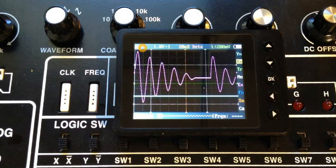We have an indicator here that says 'auto' — this tells you what kind of trigger mode we're in. It's going to automatically trigger as opposed to manually trigger. This is the volts per division; each one of these graticule spacings is one division, so we can see it's one volt per division. One volt would be from here to here. 20 microseconds is the time base, so 20 microseconds per division means between this division and that division is 20 microseconds of time as we sweep across.